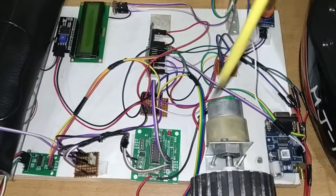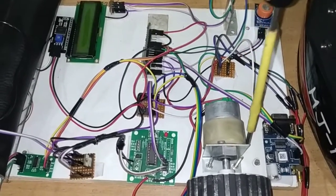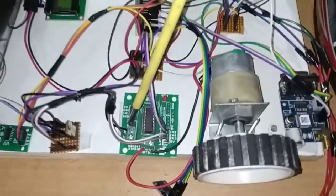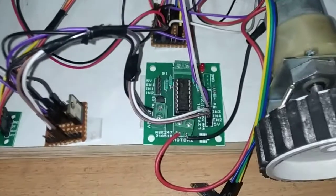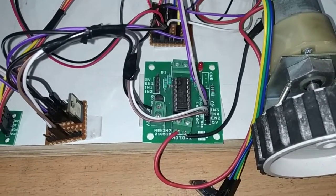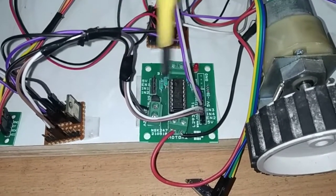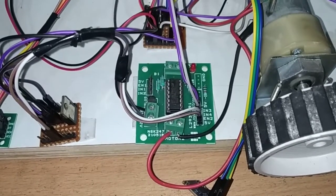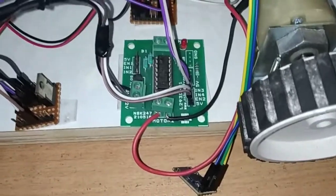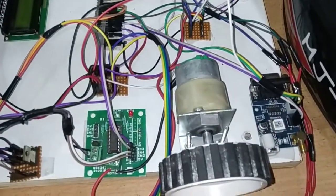To control the motor from the L293D: this is a 60 RPM DC motor requiring 12V power supply. Ground and 12V are provided directly from the 12V power junction — whatever 12V I am getting from the adapter, I connect that 12V and ground connection directly to the L293D driver module for the motor's power supply. The 2 motor output pins of motor 2 are connected to my DC motor, and in this way I control the 60 RPM DC motor.